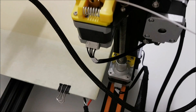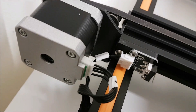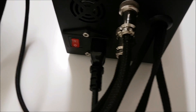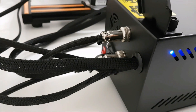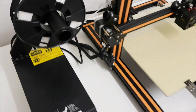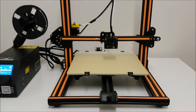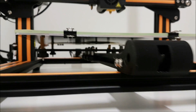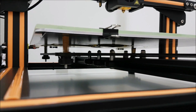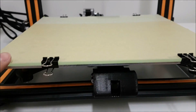Here are some more details of how this thing looks on every side, so you can see every detail, how it's made and what parts it contains. I've already modified the side fan duct nozzle to hit exactly the tip of the nozzle — I made it a little bit longer, which improves print quality by blowing air in the right direction. The original one was a little bit short and didn't hit the right angle. I'll put a link in the video description so you can download and print the replacement — it looks just like the original, just a little bit longer.